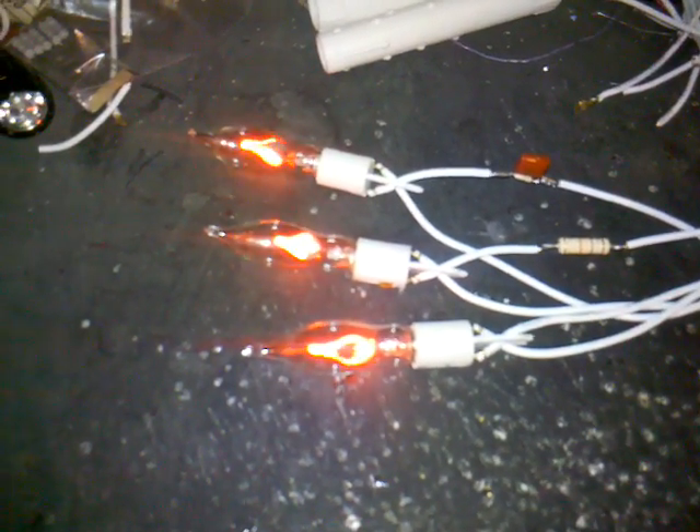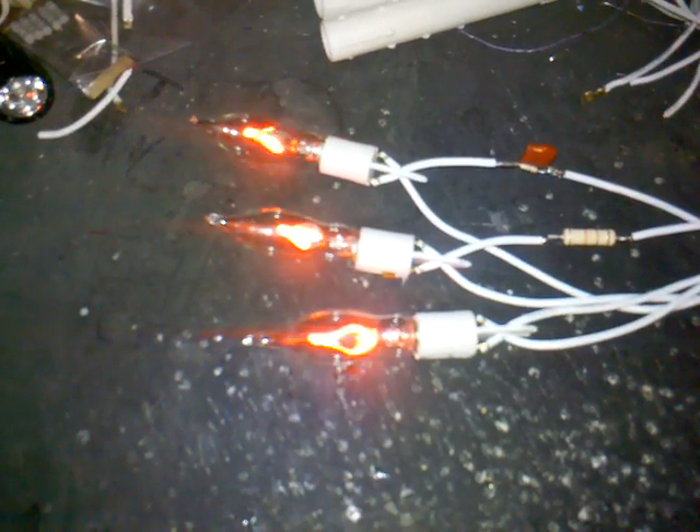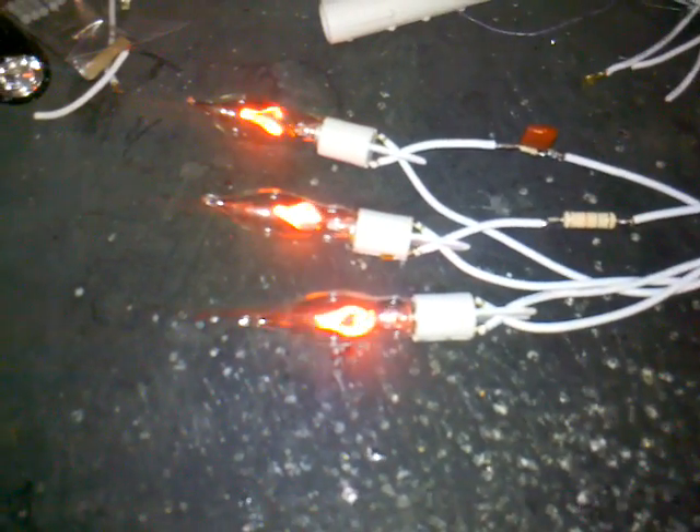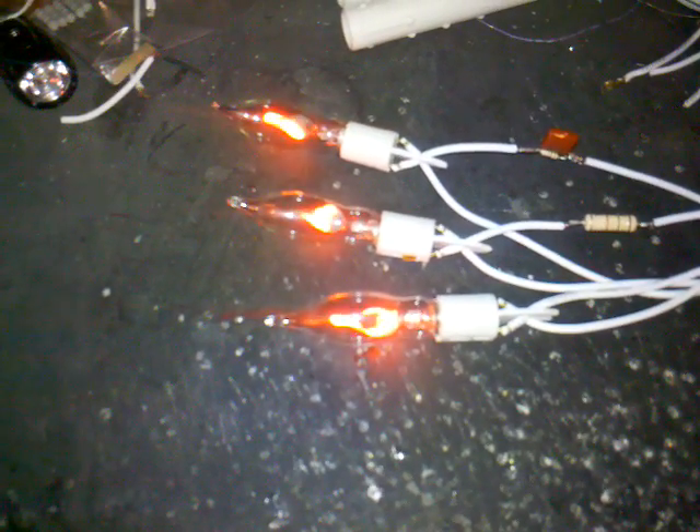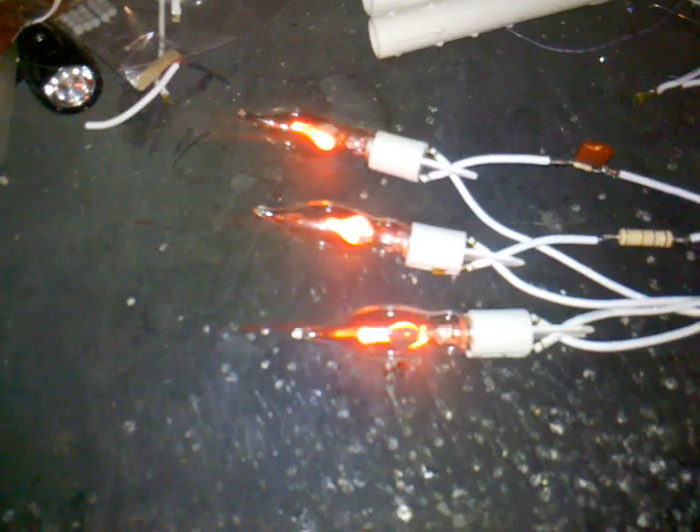Actually, the lamp itself will be a quarter, so the resistor will be dropping three quarters of that total power. The power I measured for that light was about 1.5 watts, so a lot of heat gets dissipated in the base, and in the past I've tended to find that the resistors in the base tend to fail.